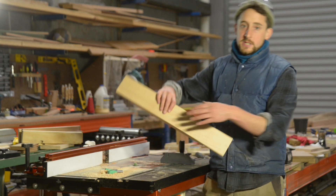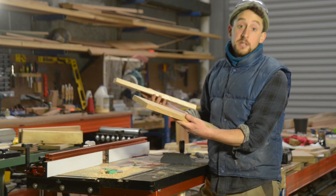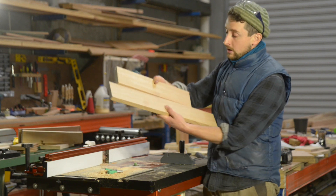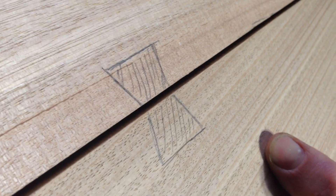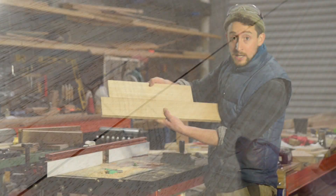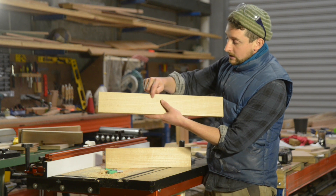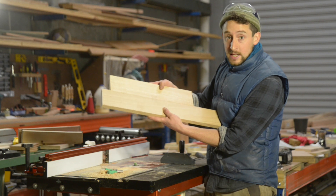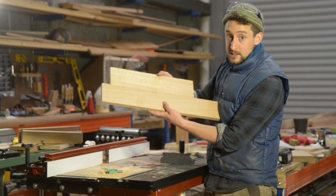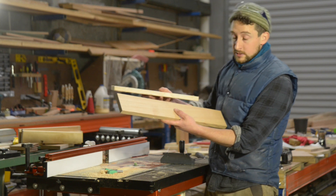The first application I want to show you is when you might use a butterfly to join two pieces of flat stock in a decorative way with a visual butterfly. I've just drawn one on in grey to demonstrate what I'm going to be doing. There are two parts: first, cut these little dovetails in both pieces, and then create a butterfly that's exactly the same size to slide inside those dovetails.